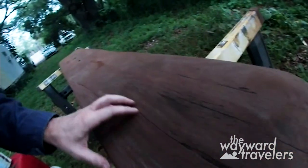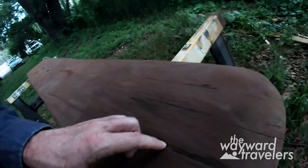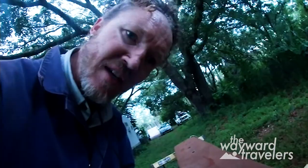I'd like to blow this out with the air gun and see if we can get some adhesive down there in that joint before we do the epoxy. Just an additional layer inside to help it hold, and then the epoxy and the fiberglass on the outside, and then possibly the paint. Oh man, that sure is pretty. Dang it, that's pretty.